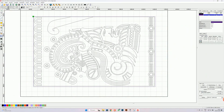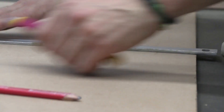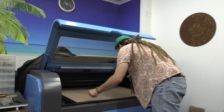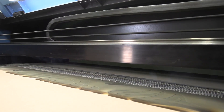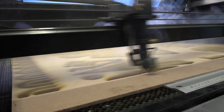There are no other settings that need to be changed, so now that I've done this to one panel, we're going to repeat the process to all of them and save them. We're using 6mm MDF because it's going to be secured to a metal structure which is quite high up — I don't want 3mm because it could eventually warp. The reason I chose these settings is because I want to see a clear contrast between the engraved piece and the natural wood, so that standing from a distance you can clearly see the difference.